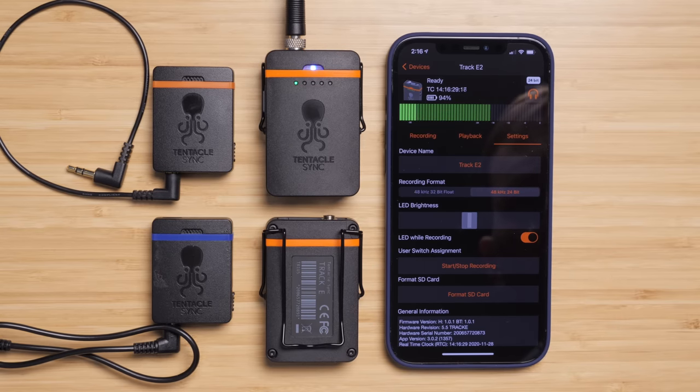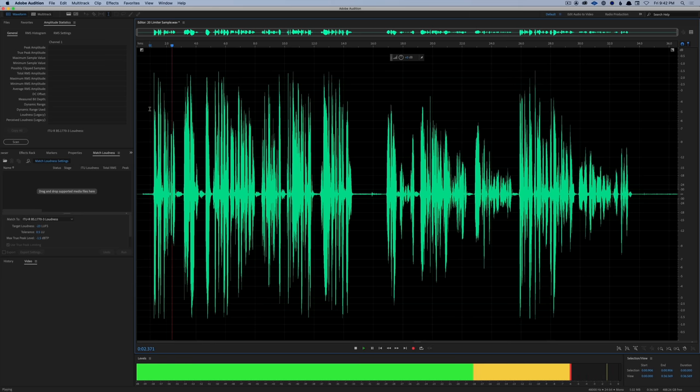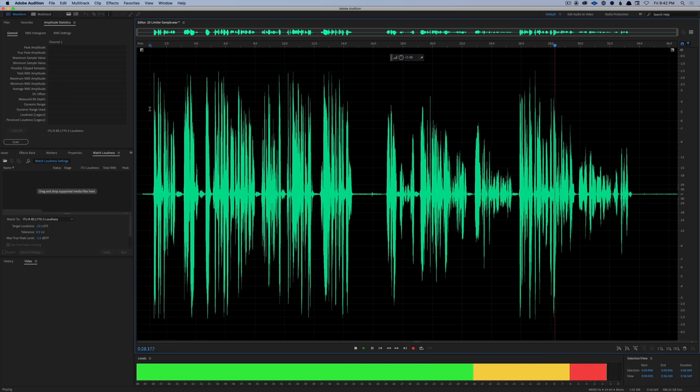The more traditional way of doing recording is in 24-bit, and this can do that as well. If you go into 24-bit mode, it does have what's called a limiter. The limiter will make it so that when you do get those parts that are very loud, it should capture those and pull that down a little bit so it doesn't distort. Here's a sample of that. Now we're at 46 dB, running very hot, and you can hear the limiter engaging. Typically you wouldn't run it this hot. Let's bump it down to about 40 dB. Here it will just hit the limiter every once in a while when I get just a little bit louder. Checking 1, 2, 3, 4, 5, 6, 7, 8, 9, 10. And now here it is not really hitting it. So that's an example.